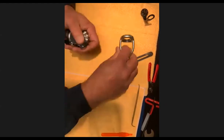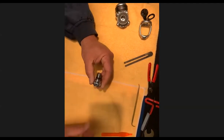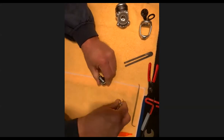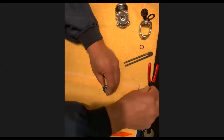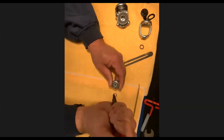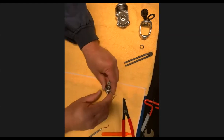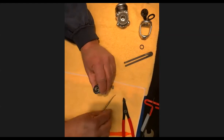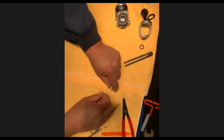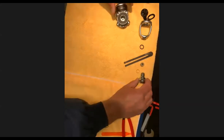So that's the yoke valve, or the yoke. Here we have already a bad O-ring. So we would take our O-ring remover. We slide that O-ring off. Set that off to the side. The filter gets pulled. The snap ring for that. Filter gets poked out. Behind the filter, we have a little spring. There's a little spring. That part's ready for the ultrasonic cleaner.